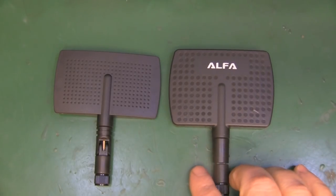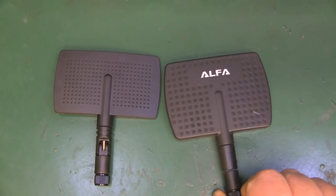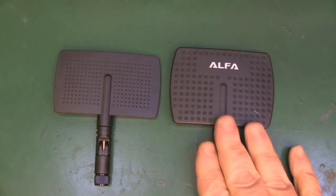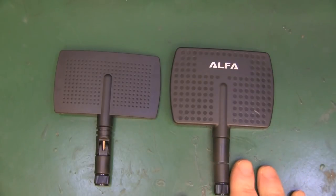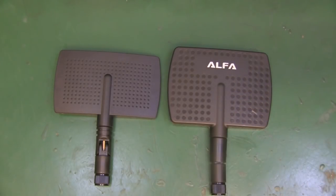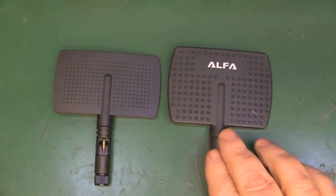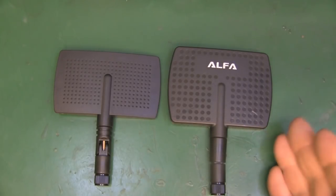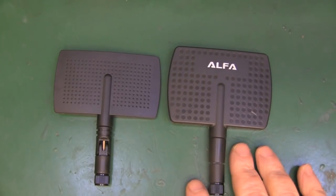This particular Alpha card I've had for a very long time. I've taken it apart a few times to basically copy the inside of it. It's a rock-solid antenna, and I used to use it as a yardstick because this Alpha is 7 dBi, and it really is 7 dBi — pretty much spot-on. I used it to test how well some of my early designs performed next to it, such as a single bi-quad, which I normally say is around 9 dBi — though depending on reflector thickness and build quality, you can increase that a little bit.